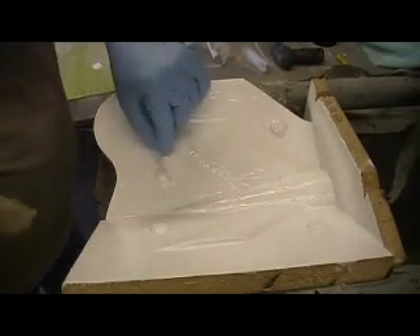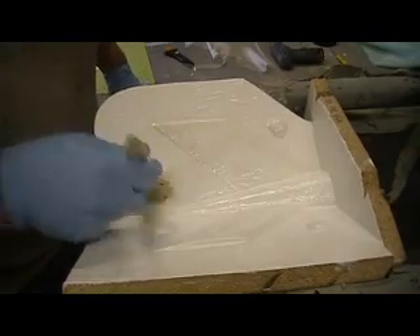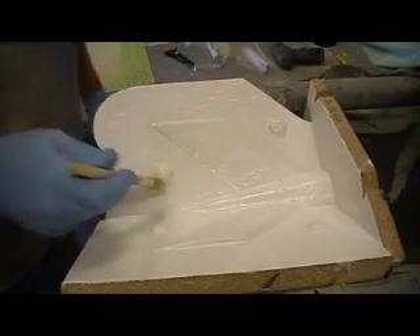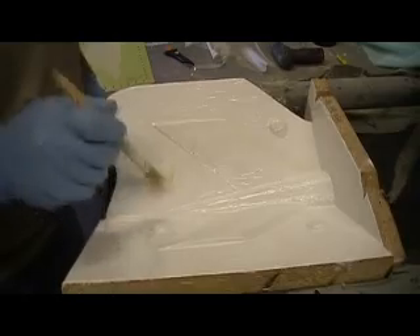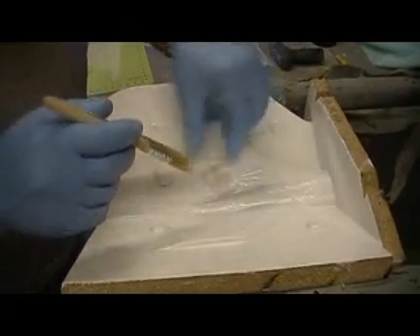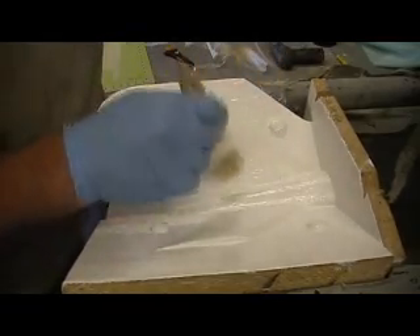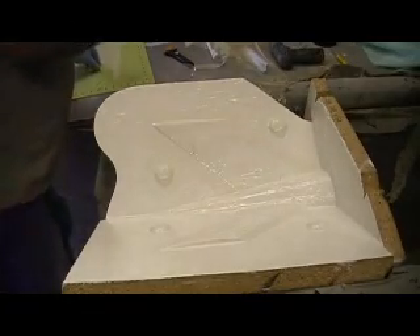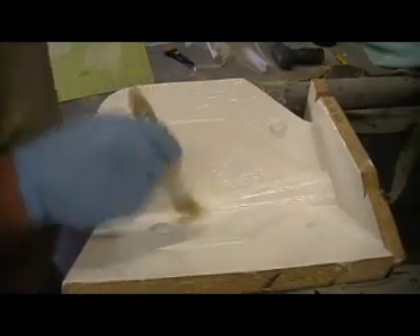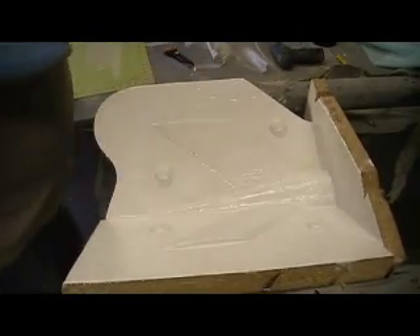If you've made a mold and had chipping issues, it's because your resin was too thick. You need that thick resin but you also need fiberglass in between that resin. If you don't, it's got to have something holding it together. I made plenty of molds where I didn't do that, and I had cracking issues — corners wanting to chip. That's why I do this now.